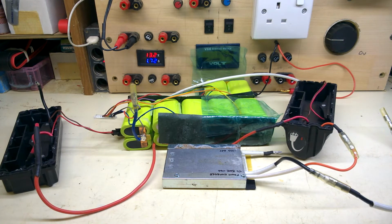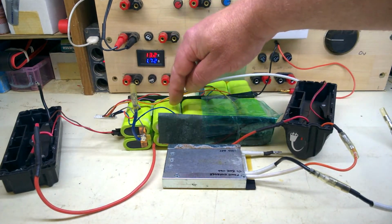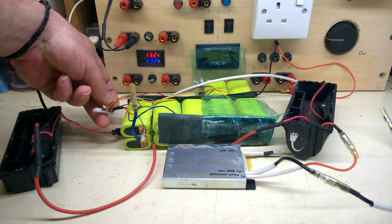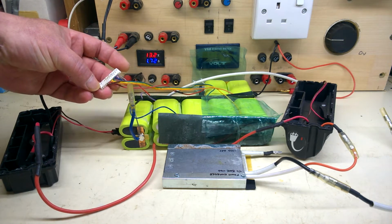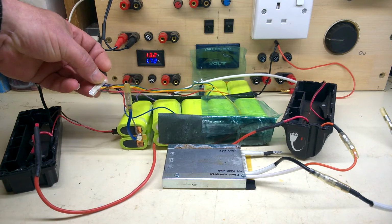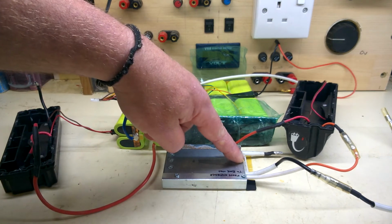So what's the batteries on this? It looks like lithium ions, 4 in parallel. 1, 2, 3, 4, 5, 6, 7. Making nominal 24 volts, 29 volts when full. This is a small balance connector. Pete was complaining that these wires were getting stretched and he was thinking of extending them, as they were plugging into the BMS obviously.